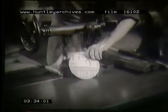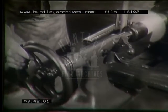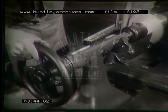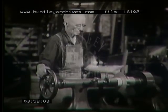Now let's do a little spinning, starting with a simple operation. We put in the blank approximately in the center and clamp it there. With the lathe turning slowly, loosen the tailstock slightly as you hold a flat stick lightly against the edge of the blank. Don't have the blank too loose, or it'll fly out, nor too tight, or you'll bang up the edge. Pressing lightly against the edge centers the blank. Tighten the tailstock, and you're ready to proceed.